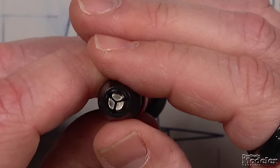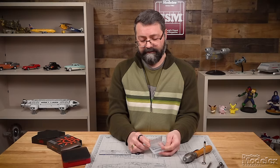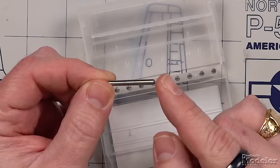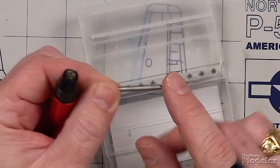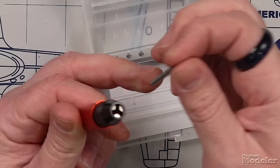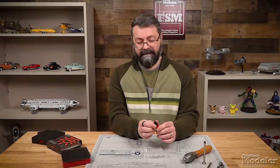Something else: if you've been keeping track of micro drill bits recently, you'll know a number of companies have come onto the market making them. They're now putting thicker shanks on the ends of these drill bits, and those don't fit easily into a collet on a typical pin vise. However, on a three-jaw chuck, that fits right in there and tightens down very, very nicely.